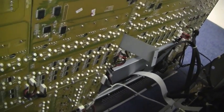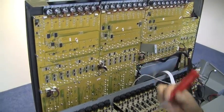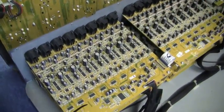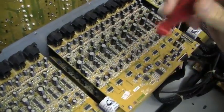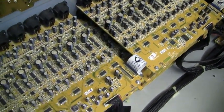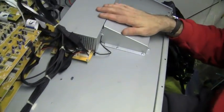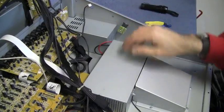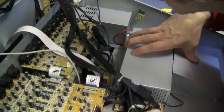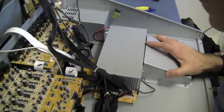I'm going to have to do a little bit of snipping here. Welcome to the inside of the Behringer X32. These here are all the ins and outs, all the famous Midas preamps and things. Nice big switch mode power supply there — two of them — this is probably a mains filter thing, and this contains a big fan. So I guess that's the power supply for everything.